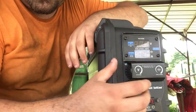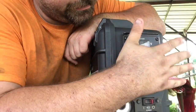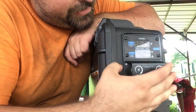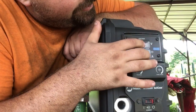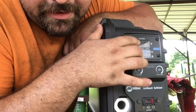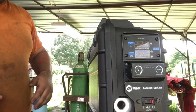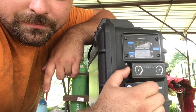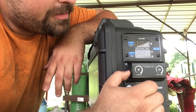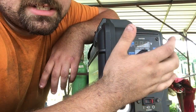Arc Reach is preferable because it gives you full machine control right at the front. Let's look at the controls — these little dials are inside a little casing so they're very difficult to bump off. The actual screen is behind a piece of plexiglass, so there's no exposed screen to get damaged. There are two dials: if hooked up to an Arc Reach machine you can adjust voltage here, and it has voltage compensation. The other dial is wire feed speed, which we use regardless of machine type.